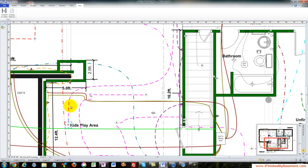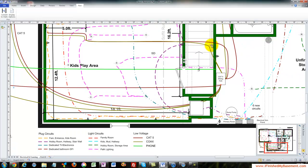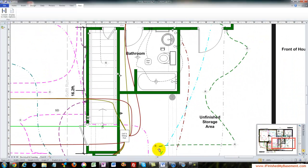There's one more light in that same series — a recessed light tied to that switch that illuminates the chalkboard in the kids' playroom. The solid lines you see are the cable TV lines, internet lines, and speaker wire. I made those solid so you can see they come back to the Cat5 wiring hub. You want to represent all of those because they look a lot like electrical wiring when you're down there working. You also want to be sure to include a legend — I have my light circuits, plug circuits, and low-voltage stuff like Cat5, coax, and phone all listed.